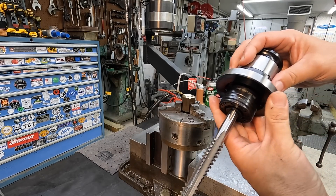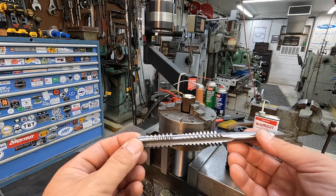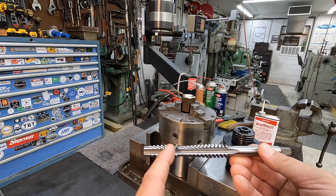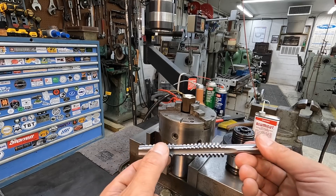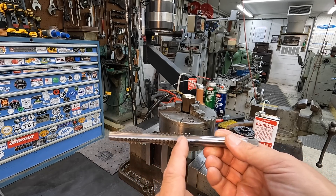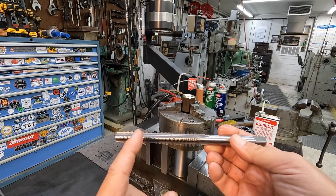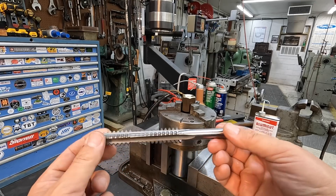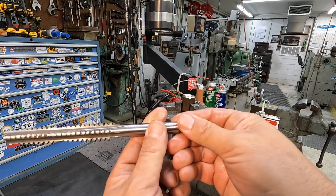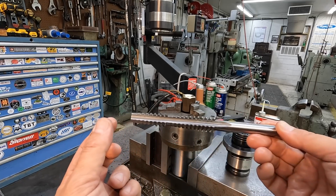There's our tap — it fits into an eleven-sixteenths tap holder for the flex arm. I wanted to point out that this type of tap is actually considered a tandem tap, so you have two cut areas. The first area looks more like a conventional V-thread and relieves most of the center of the thread. Once it clears, it comes up to the second area of the tap which finishes out your Acme. Instead of cutting one full thread at once, it relieves part of the thread with the first section, then the second section finishes and cleans the thread out. It's not advised to go in reverse with these taps — this is designed for through tapping, not bottom tapping. You want to go all the way through your workpiece.